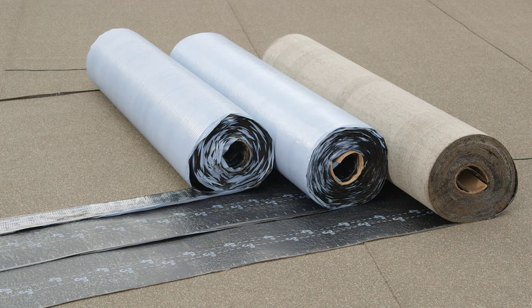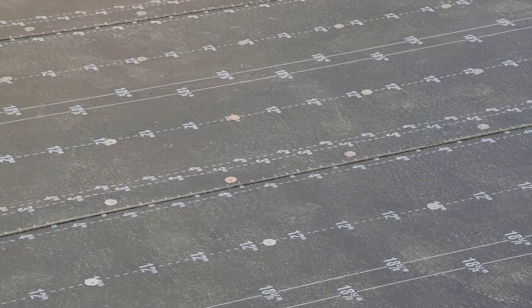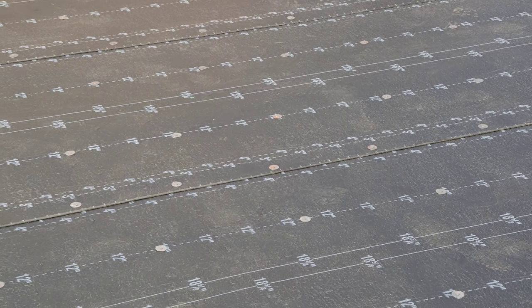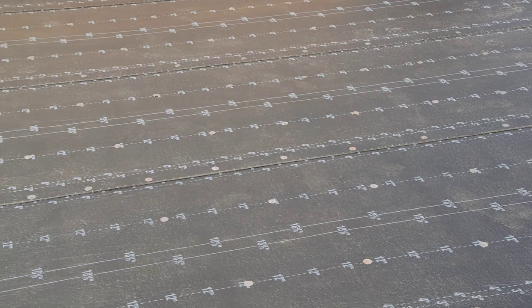While different combinations of base plies can be used with the cap, what we're showing today is a 3-ply system which includes the nail base, the self-adhered base, and the cap. Owens Corning Deck Seal Base Sheet should be used in conjunction with the Deck Seal SA SBS cap. Do not use Deck Seal Base Sheets in a torch-down application.